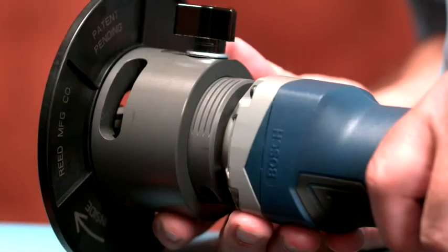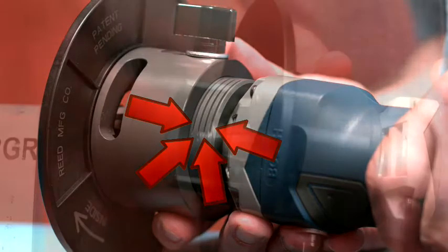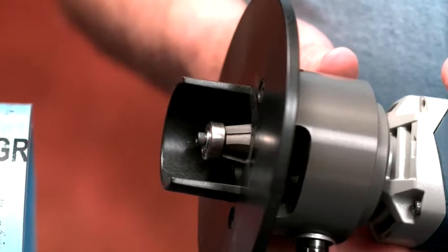To the left side of the adjusting knob are four engraved lines on the adapter with one-eighth of an inch increments. When using the R-bit 1 with the adjusting ring all the way to the bottom, the beveler will cut a five-eighths of an inch long bevel.